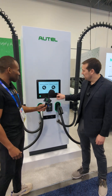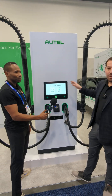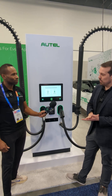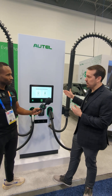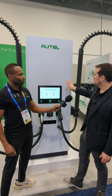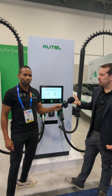We are looking for standalone units — 400 kilowatt dual-plug standalone units — and I feel like I'm standing in front of something new. You definitely came to the right place. Here at CES 2025, this is the unveiling of this product, so you guys are getting to see it first. The DH-480. So, 480 kilowatts. We use 40 kilowatt power modules on this one. You can configure it anywhere from 240 up to 480 in any 40 kilowatt increment. This is the dual port configuration, but you can actually put up to four ports on this charger — two more ports on the back side as well, if desired for a certain location.